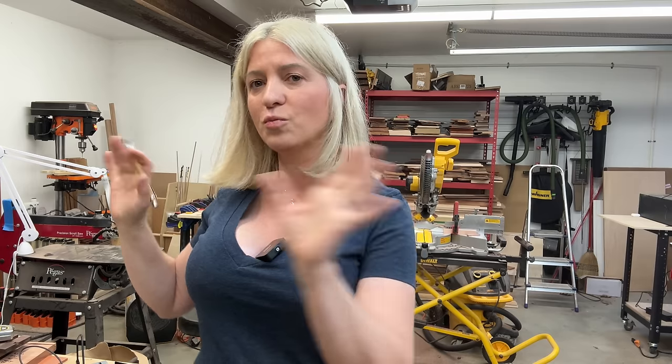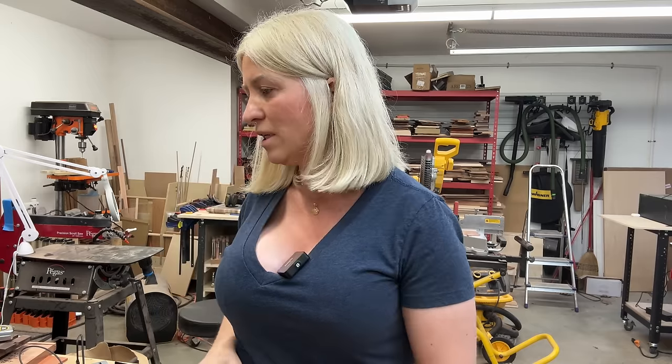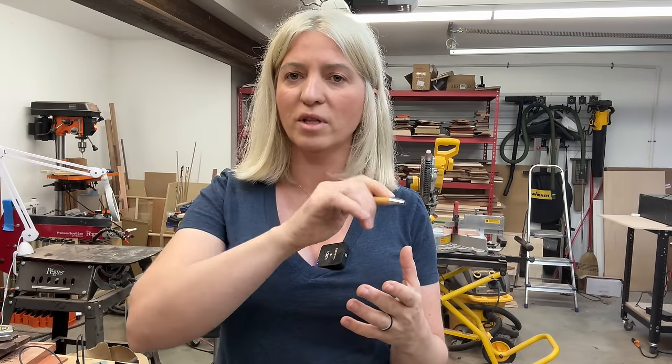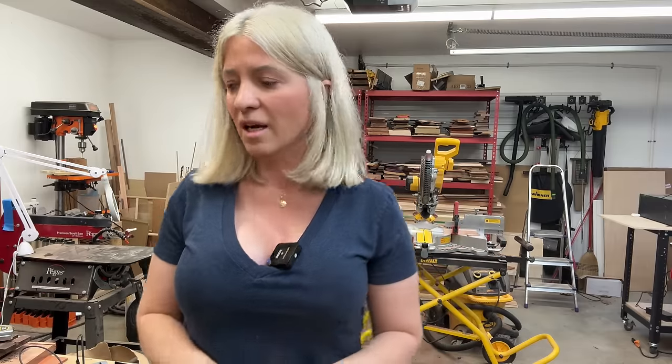As you can see, this machine is really versatile — it can engrave on all woods and all metals. It is really portable and really fast because the machine does not have a gantry that moves. A normal diode laser has the laser head moving left and right, but this one uses mirrors, so nothing moves inside. That makes it super fast and saves you lots of time.